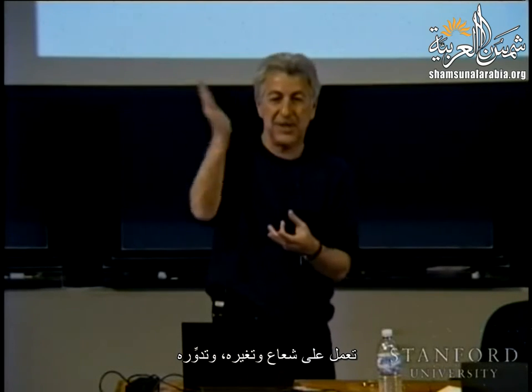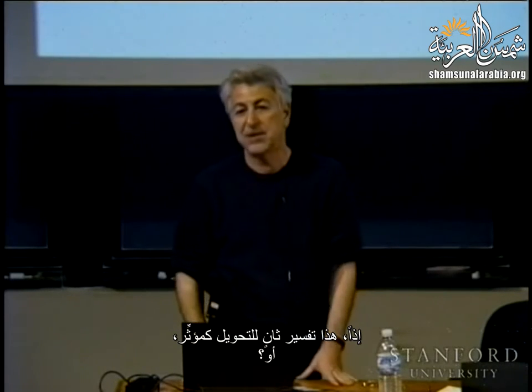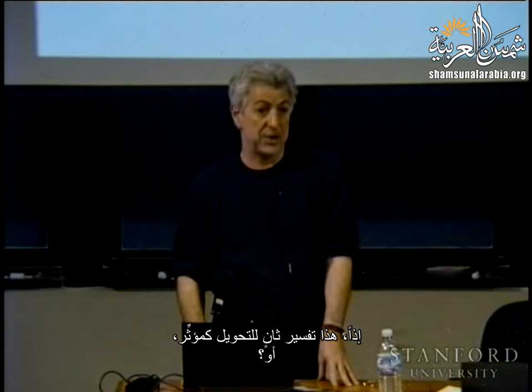Now, we saw also that there is another role this homogeneous transformation can play, and the second role, or third role, whatever. Do you have an idea what we can use this transformation for? What can this transformation help us do? Yes? Operations, that is, we can interpret the transformation as an operator that is acting on a vector and changing this vector, rotating the vector, or rotating and translating that vector. So this is a second interpretation, the transformation as an operator.